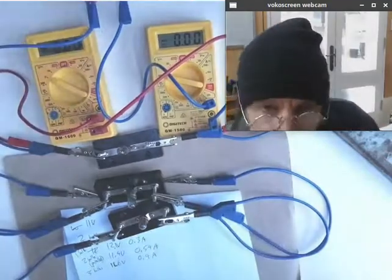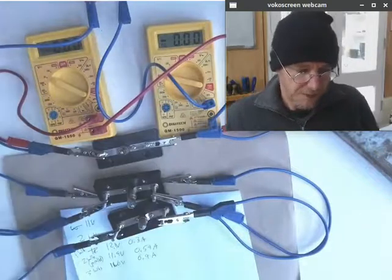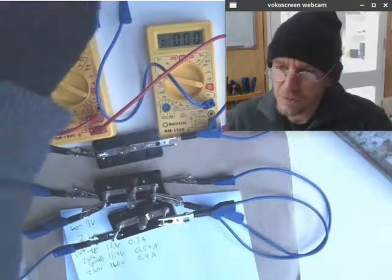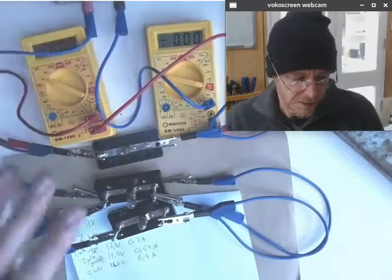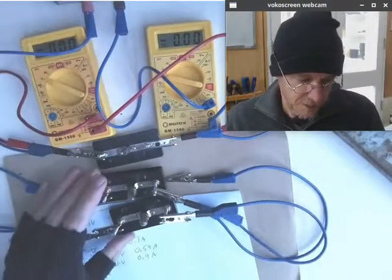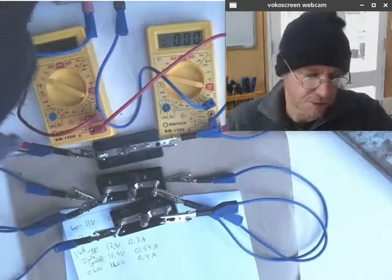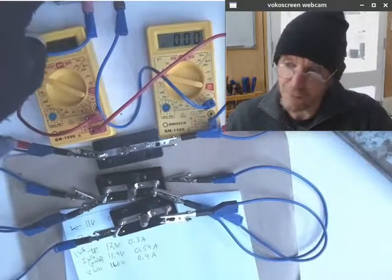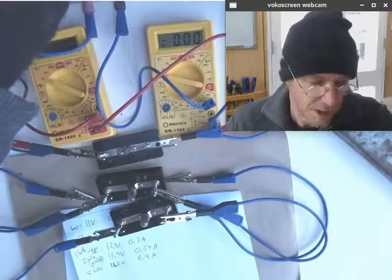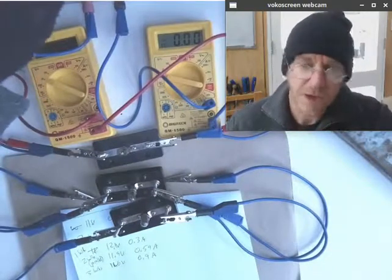And this is in some ways the essence of the electricity topic, that what you see happen in a circuit in terms of voltage and current doesn't depend so much on what your source is. It depends partly on what your source is in terms of its voltage, but it depends at least as much on what you put in the circuit. So if you put low resistances in the circuit, the power supply is forced to try and provide very high currents that might in fact then impact the voltage. But assuming it's capable of putting out more and more current without the voltage dropping, it will. It'll put out instantaneously all the current it has available.